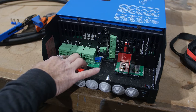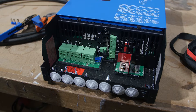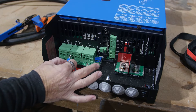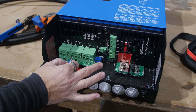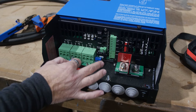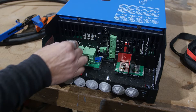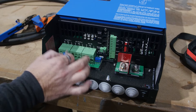These terminals are spring-loaded, not the more traditional screw type. The first thing you'll need to do is put ferrules on your wire. These are critical because the way these spring terminals work is you push the terminal into the spring-loaded connection point and it grabs — but it will not grab bare wire. You need the ferrule.